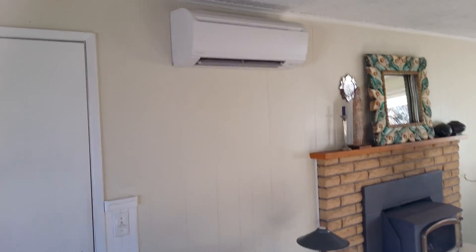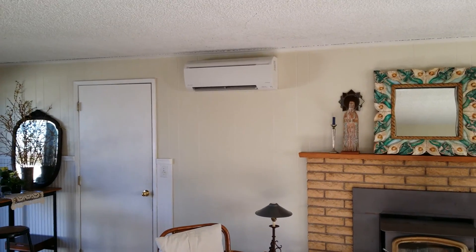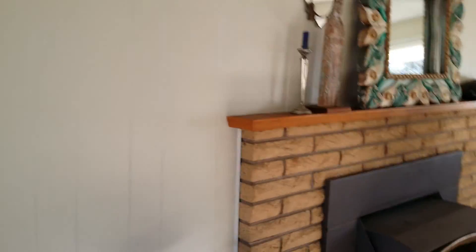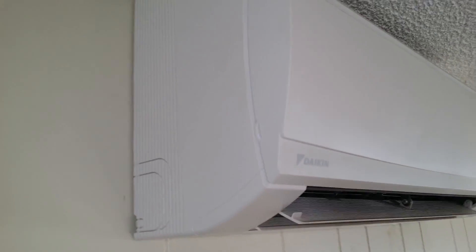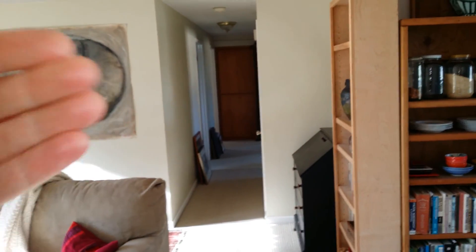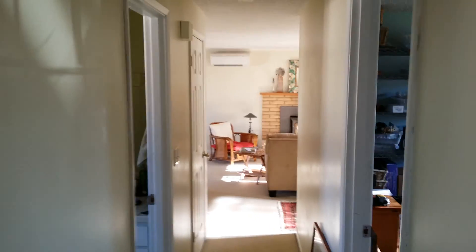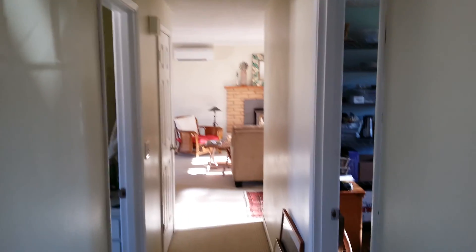This is a 31 inch wide unit here, and there it is on the wall. From the head we're looking right down the hallway. When we do this kind of displacement, that heat is going to terminate — depending on how high we put the fan speed — as it gets back into the hallway right around this area, and then it just spreads. So when I get to the back of the hallway I'm looking right at the head. That's how it works when you're looking at your own place and wondering where you'd put things.